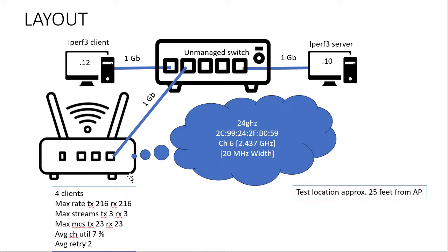Now we're going to introduce our wireless access point. At the time there were four clients on the wireless network — I made just a few notes given to me by the AirCheck. Everybody knows Wi-Fi changes on a whim, so just document whatever you've got and move on. I even wrote down that I was about 25 feet from the access point. If you have multiple access points with the same SSID, you might want to document the MAC address of the access point you're on.